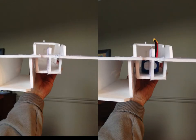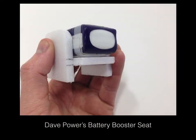Here's what the new prototype looks like — you can see the nacelle on the left, the motor mount, and the extension of the floor. Two things I'm happy about: it gave me a lower profile for the fuselage on top of the wing plate, and I have more room in the bottom of the aircraft. Because it's hidden by the nacelles, it doesn't affect my profile — it's a nice change that improved aesthetics while giving more functionality. On the right you can see the battery placement below the wing plate. If my calculations are off, I can always build a battery booster seat to bring the battery up in the aircraft — it's easier to move it up than down once the plane is done. I'll do a follow-up video on my MIG FA version 3 once I've done a complete build and more calculations to see where my true vertical CG actually is.